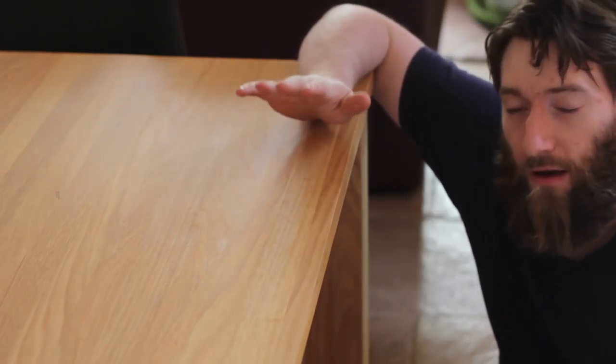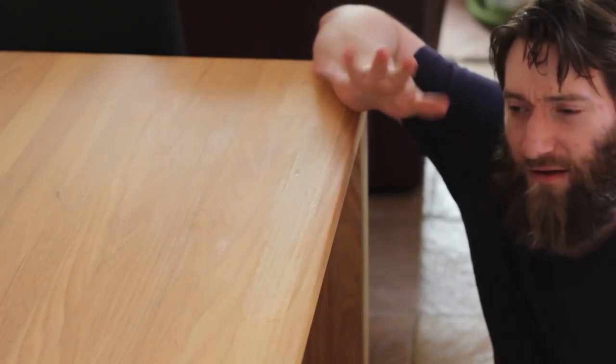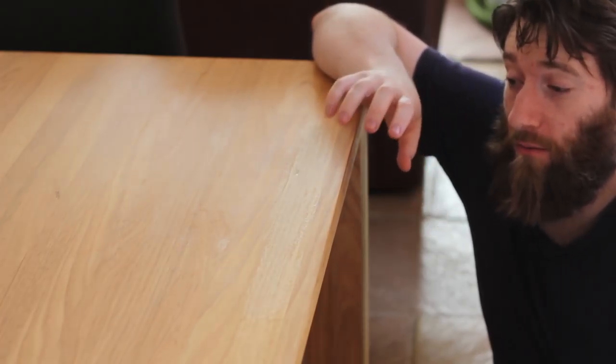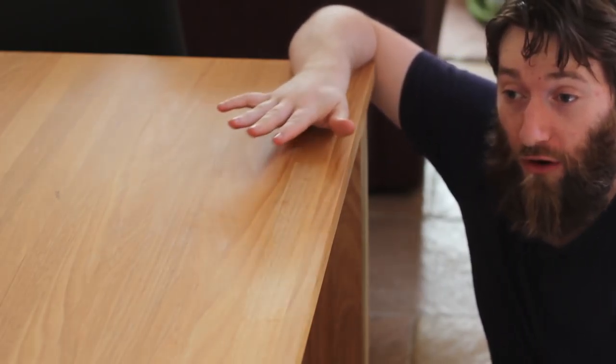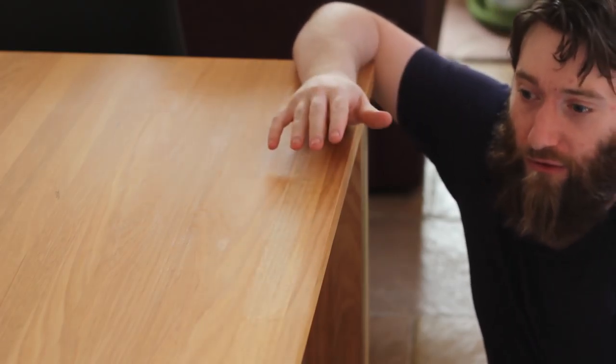Back when I made this dining table for mum in May of last year, the table went fine and the finish for the most part went quite well too, except for this one spot here. Now at the time it was fairly cold, probably about the 10 to 15 degrees Celsius range, which polyurethane can have trouble curing. However in this case, I think it was the filler I put in that didn't quite entirely dry before the polyurethane went on, because it was so cold.